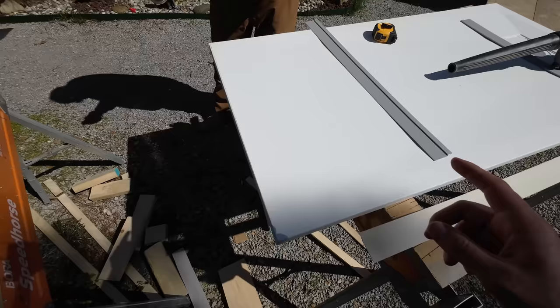All right, so we've got to shave off just a little bit of this base. We're just a little bit too long, specifically in the front. So we've got a pencil mark here that we're going to try to freehand cut this. We don't have a wet saw right now, but you can see we just got to take off maybe a quarter inch at the front down to nothing at the back.